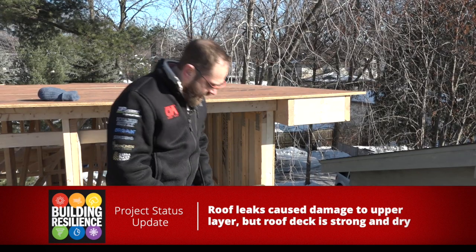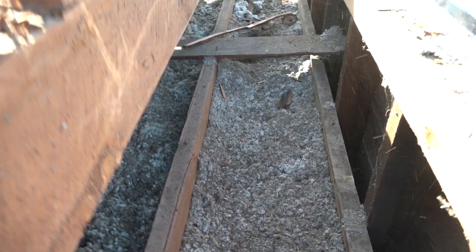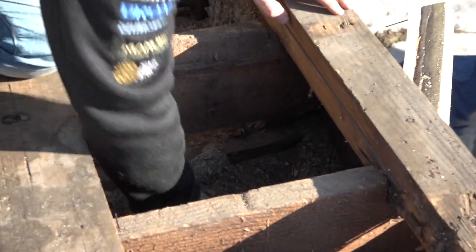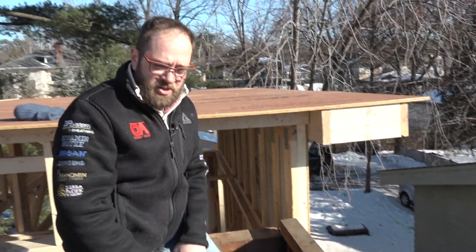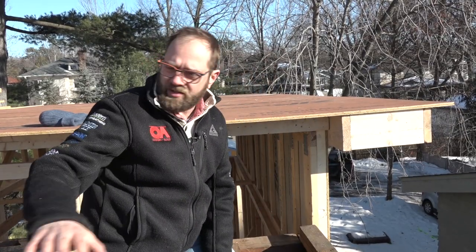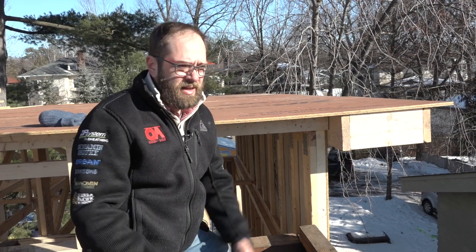So we also have a huge opportunity now. We have this like two-foot cavity between the old roof deck and the plaster ceiling below. There's currently about two inches of beautiful cellulose in here — not enough for Minnesota. But we have this giant void, and so what we're going to do is come back, net all of this on both sides, and fill the cavity full of blown-in fiberglass insulation. We'll end up with 24 inches of insulation.